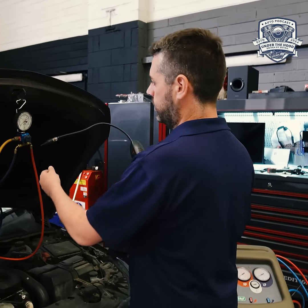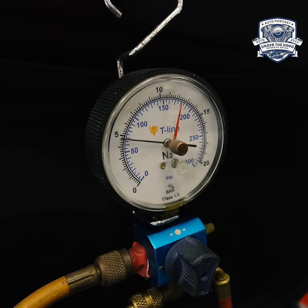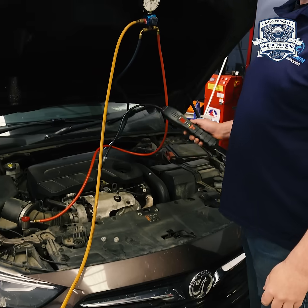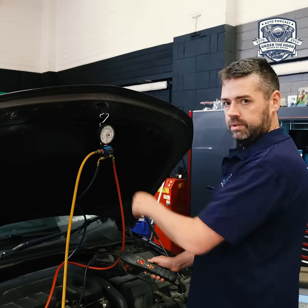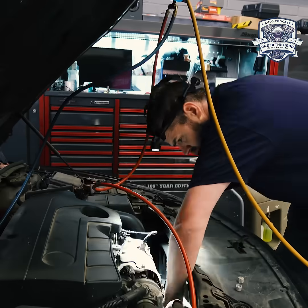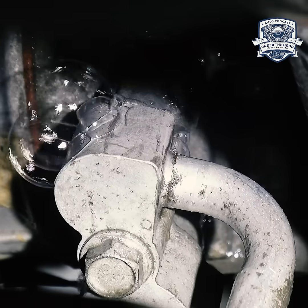What we're going to do is give it a wee dart of nitrogen to show you what I'm looking for. We're not even getting a chance to fill this because you can audibly hear it — the gas is running straight out of it. So there's quite a bad leak. Let me just stick my head in here and see where the leak is. Can you see the bubbles? So in that instance, we have to repair this leak before we can go any further, because hopefully all that's wrong here is a wee O-ring worn out.